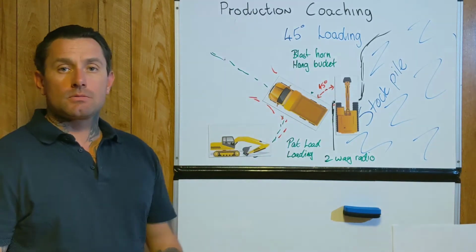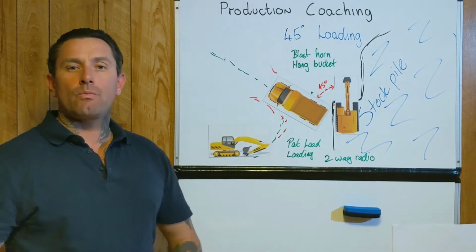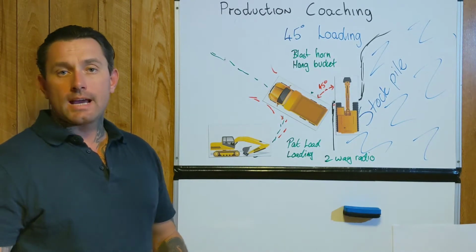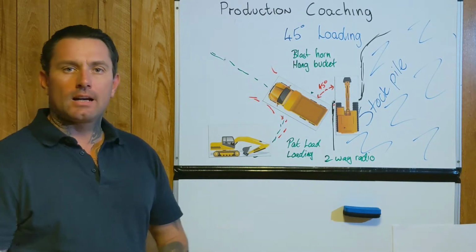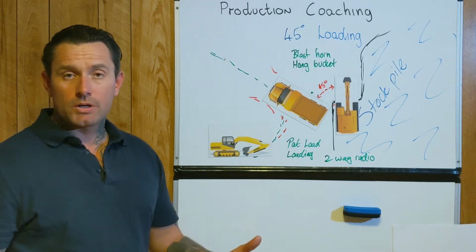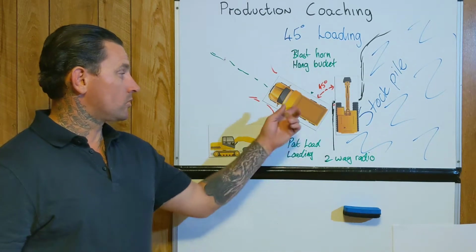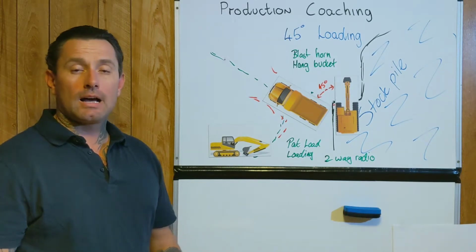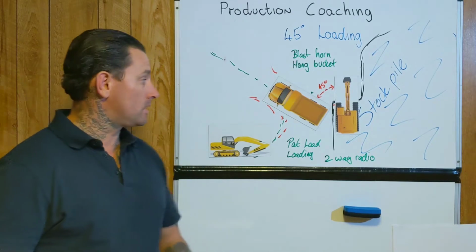And when you're first starting out, some key ones to really be aware of: make sure you've got that window chopped out a little bit. Make sure you've got your wireless radio down that little bit. If you've got a two-way radio, have that down a little bit, because if you're on a big site, you don't want to lose communication, but if you've got a lot of radio chatter, nine times out of ten, when the operator puts the last bucket on and wants you to go, someone's jabbering on the two-way, and you miss that signal.